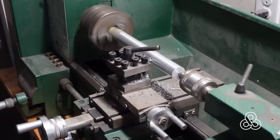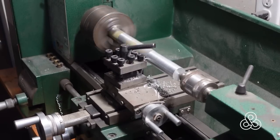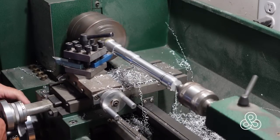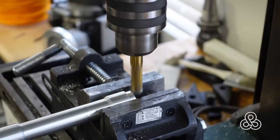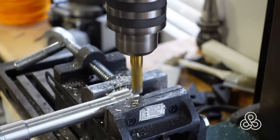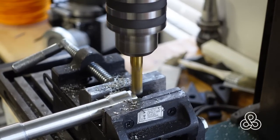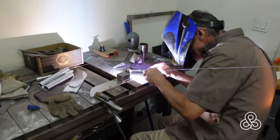The piston that goes inside is fairly long, so we're going to cut it down and make it nice and smooth to fit the bore of the cylinder. I also cut some grooves in it — later on I'll be putting some Teflon bushings in there to give it better sliding action, but for now we'll try it as-is to test the prototype. One end of that piston will have a couple of brackets welded to it to hold a piece of the hinge that swings out and pivots around the bodywork of the car. I machined a couple of flat surfaces for those water-jet-cut pieces to fit on, then welded them in place to make one little bracket on the end.